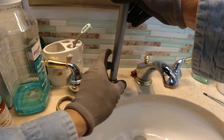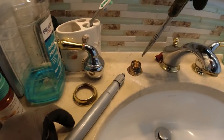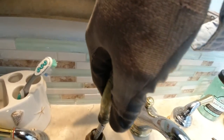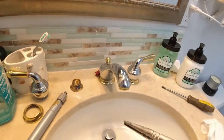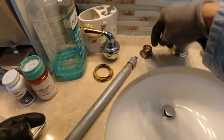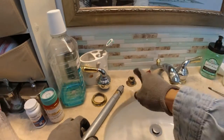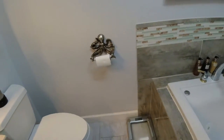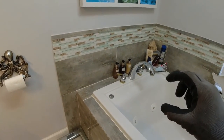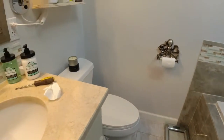I don't have to work on this valve at all. After you take the retainer out, you get needle pliers right here and just pull it straight out and replace it — your valve, your cartridge. That's it, it's simple. And after you put a new one in, put this screw right back. This one will go for the top too — the retainer goes down about two inches deep, and that thing is long.